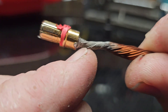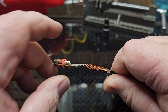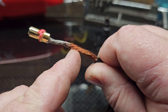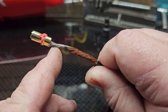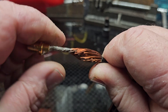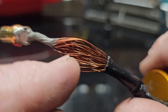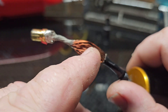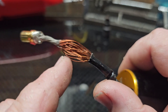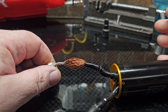You've got to tin your wire before you solder a connector on. You have to solder to clean copper — if the copper is dirty or coated, the solder will not stick to the copper wire. On brushless motors, the wire is actually insulated; each individual strand is insulated, whether they use a shellac or an epoxy type coating on each individual strand.